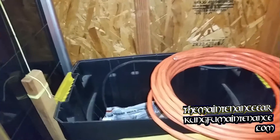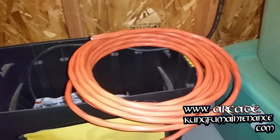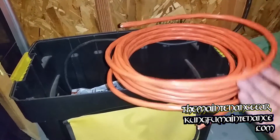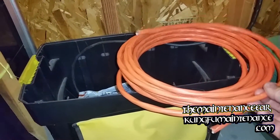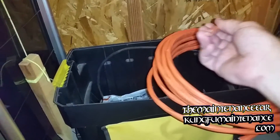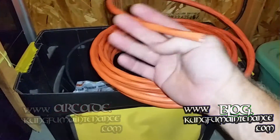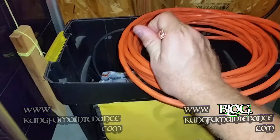I'm not gonna go super deep into this, but this is just explaining wire sizes and numbers for electrical applications. This is something that's normally used for dryers. This is what's called a 10-3 wire. Now the funny thing about it, they just like to make everything a little bit confusing here, but you've actually got four wires — you've got three conductors and a ground.